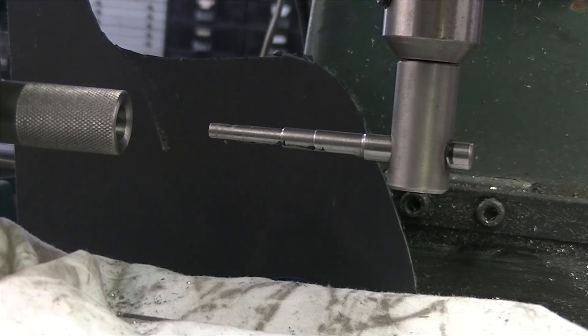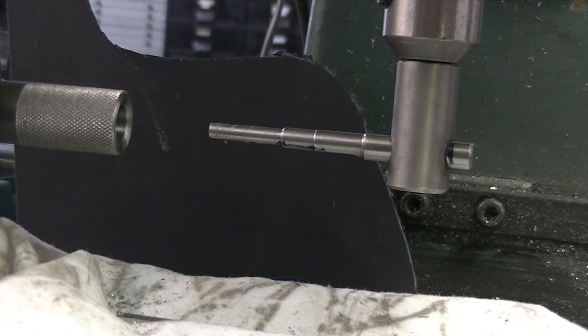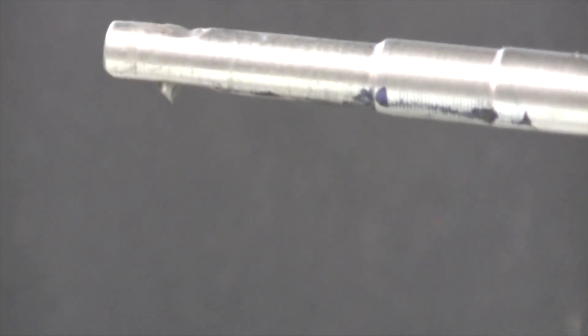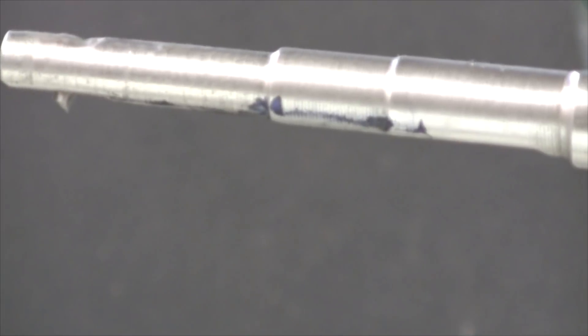The first thing you're going to need is a tool — I guess you'd call this shape like you're using a shaper, only you're pulling the contour, pulling a cutter through it moving in X and Z as you go along. This tool holds a tiny little cutter that protrudes from the bottom about 70 thousandths of an inch, and it's ground to a 57 to 58 degree angle. You could use 45 degrees — it really doesn't matter. It's got a hook on the end and it's a positive angle so that it comes in and drags the chips out.